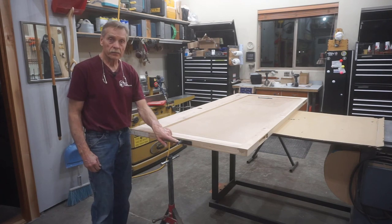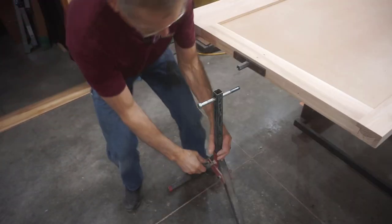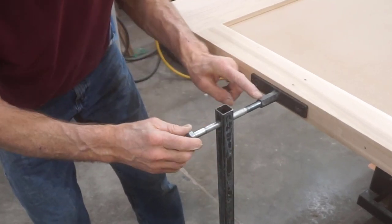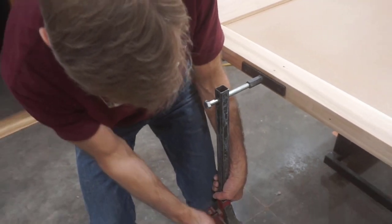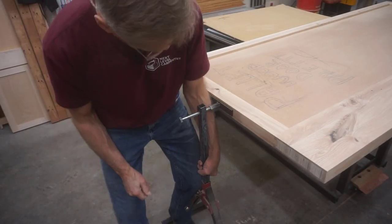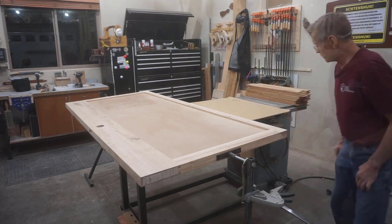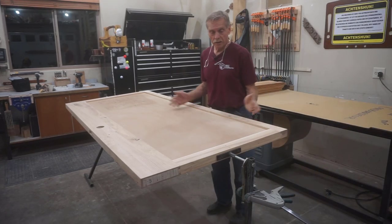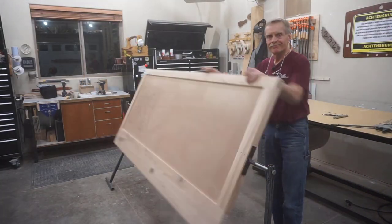I've got this threaded bracket screwed back on to the top and the bottom of the door, so all I need to do is raise this adjustment up and screw this half-inch bolt into this half-inch all-thread connector, then put a little up pressure on the pipe and lock it in place. I repeat the same steps at the top of the door, and once the door is suspended above the tabletop I use a vise grip and a clamp to hold it horizontal. Then I wheel the table saw work table out from underneath the door, which gives me complete access to both faces so I can varnish and flip it at will.